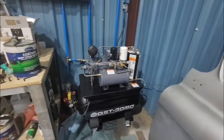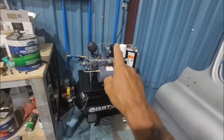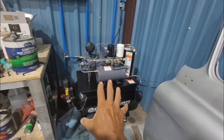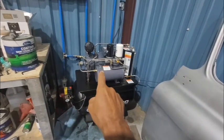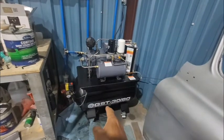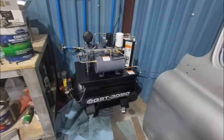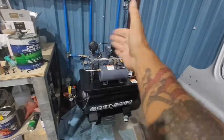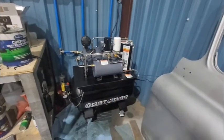Eastwood gave me a document today that I've never seen before — it must be new. It says that once a week you need to take the unit apart and empty the water out. You release all pressure first — because if you take that nut off under full pressure, it's going to hurt you — then drain the water. It's a good 20-minute job: take the top off, drain the air, drain the water, refill oil as needed, put the top back on, and return it to service.